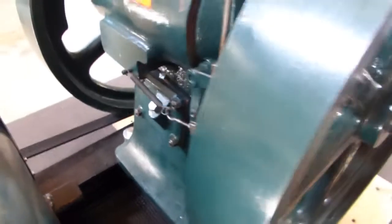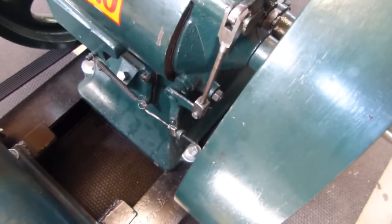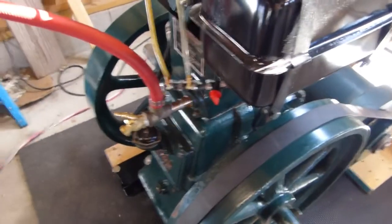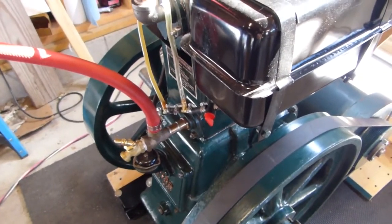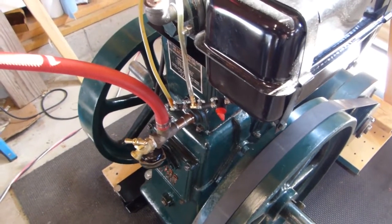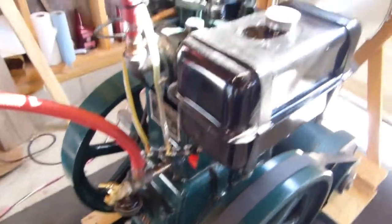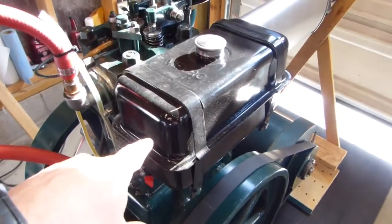Standard spring stuff, I got the engine set for exactly 650 RPM, which on the reduction gets the generator running at 1800. Between no load and full load, I'm running about 62 hertz no load and about 58 under a 3000 watt load. So the regulation isn't fantastic, but it's good enough. The fuel tank was completely rusty.